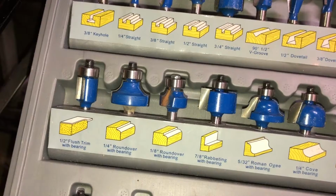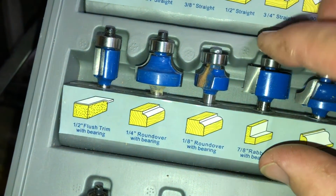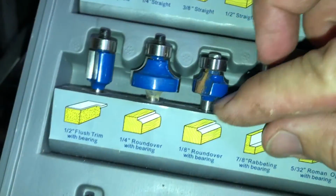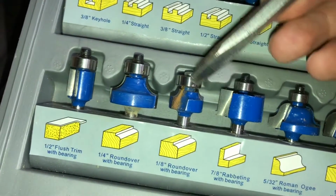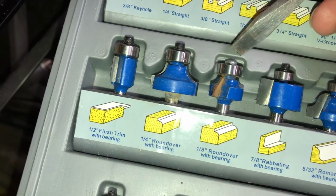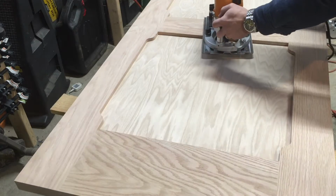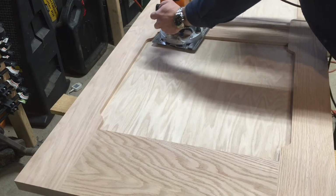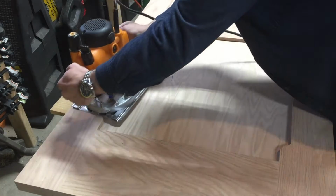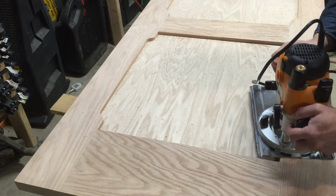After some degree of tolerable flat surface is established, it's time to dress panel edges with a 1/8 round router bit. I modified it slightly so that it would not touch the panel itself with its socket screw. The router is moved in such a manner that it produces a climbing cut, which helps reduce chipping of the wood, especially when cutting through cross-grain areas.